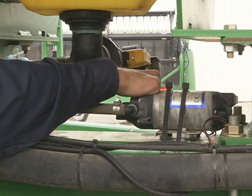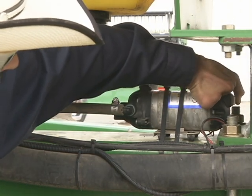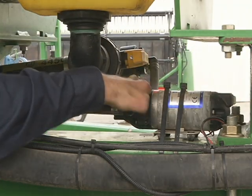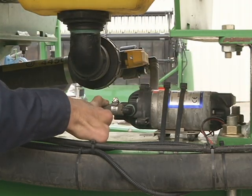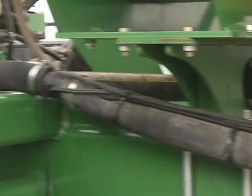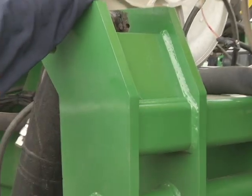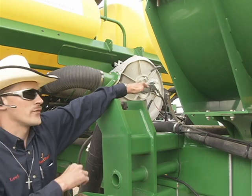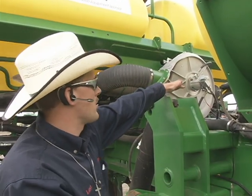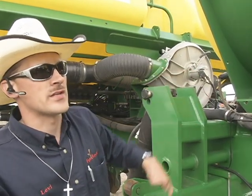This here is an agitator motor. To turn it on, there's a little rocker switch inside a housing up front — you can rock it to turn it on, rock it off to turn it off. This diverts a small amount of product with a little electric motor from the supply line into the back of the tank and causes some mixing to continue while you're going through the field. If you're going to have the motors on to mix, just make sure the valve is open to allow the product to flow into the tank.